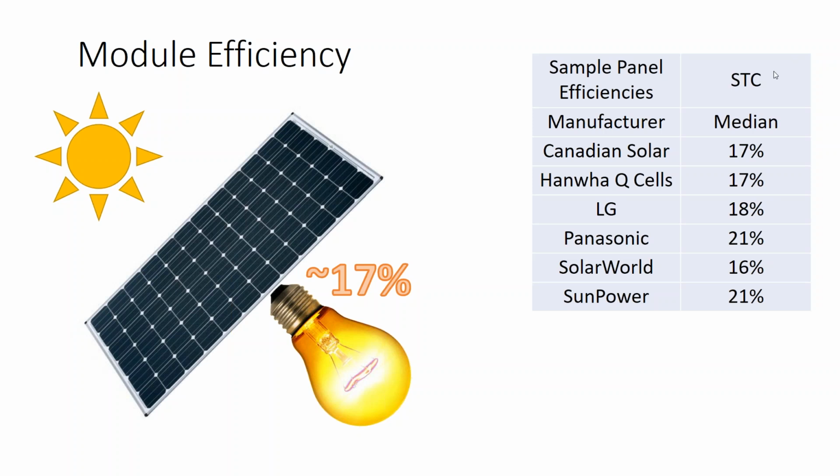So solar modules grow in efficiency every year. On the higher end, you get up into now it's more like a 22 to 23% range. On the lower end, you're in around a 17 to 18% range. So like SunPower and LG and Panasonic, they're kind of leaders in higher efficiency modules. The value range modules, your Chinese manufacturers, Canadian Solar, which ironically is also a Chinese manufacturer, they generally go in the 17 to 18% efficiency range.